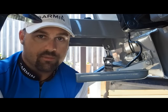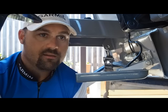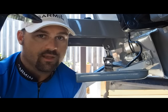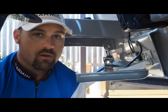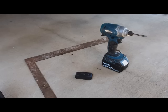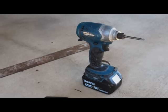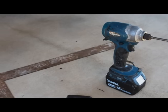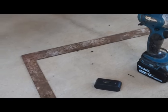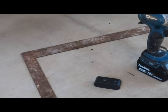I have my UHD on the starboard side currently, so starboard is preferred if you can, but port side is more than accommodating if needed. There are a few things you'll need when fitting your transducer: a good screwdriver or impact drill with a Phillips head bit, and a straight edge — I use a builder's square, but you can use a 600mm spirit level or a smaller square. Anything straight that you can run down the rearward of the hull so it protrudes and you can run a line along your transducer.